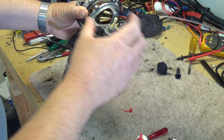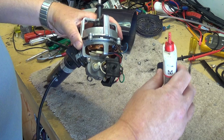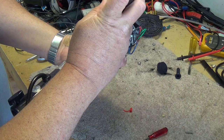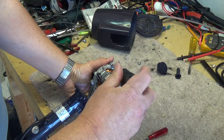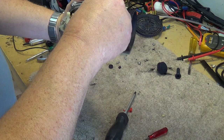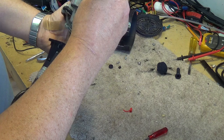I'm not going to fully separate the whole piece — all I care about is getting some oil onto the stuck bearing. I'll push it back together and reattach the screws just to keep the motor from falling apart. Now, if your motor is completely seized — this one wasn't, it was just getting stiff — you may have to take the rotor assembly right out and clean it off, especially if the oil is burnt. In this case it was just drying up, which caused the motor to overheat and burn out the thermal fuse, which will be wrapped up in that tape block.